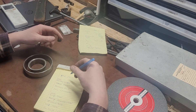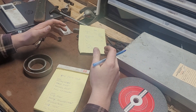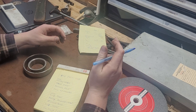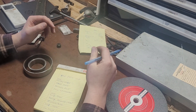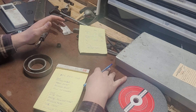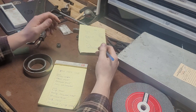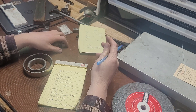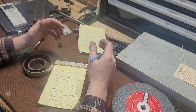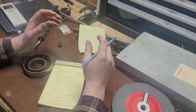You get variable speed, but variable speed can also be a con, because a lot of these motors are not inverter duty and not variable speed motors. So you really do want to run them at your 60 hertz so they don't overheat. Bridgeport pancake motors are notorious for overheating because they don't really have a fan — they're passive cooling. You really do want to run them at their nameplate speeds and line frequency.